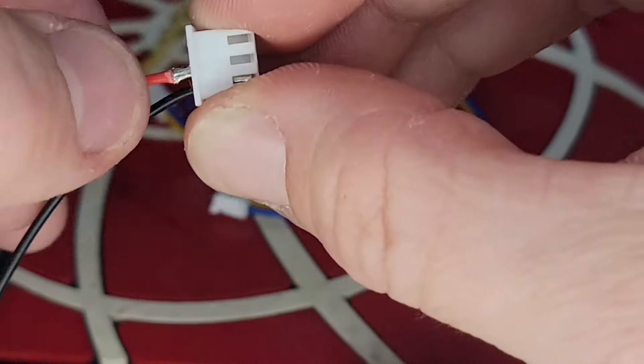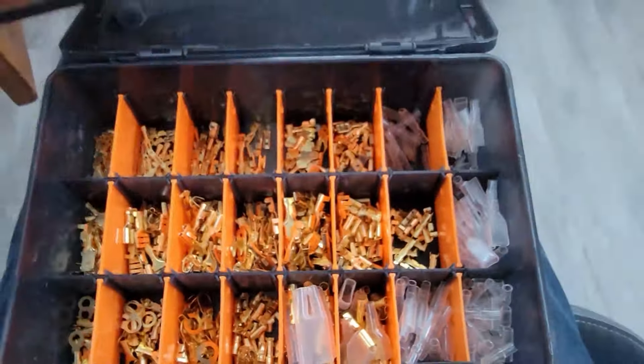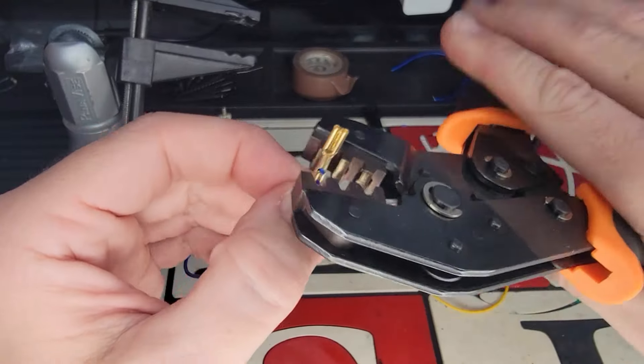Quick pull test, verify the orientation, and insert into the connector. Now I need the crimps for the speaker. We also need it bridged to mono. To do this, we crimp onto one positive wire and cut off the negative wire. Then we cut off the positive wire and crimp onto the negative wire of the other connector.